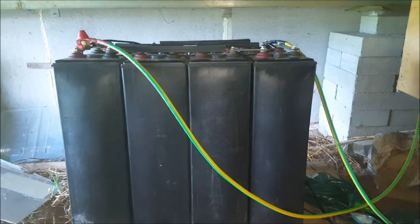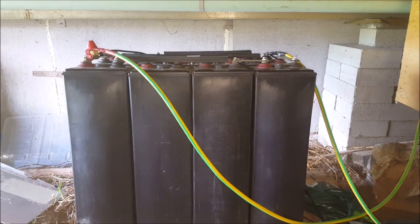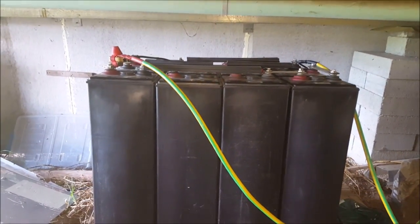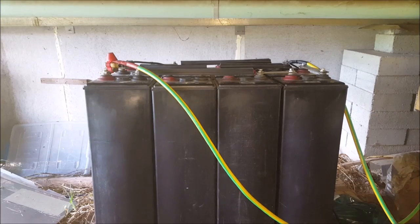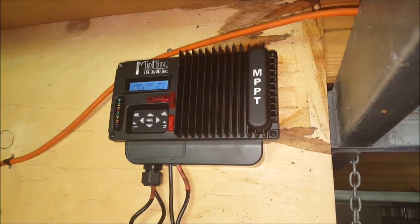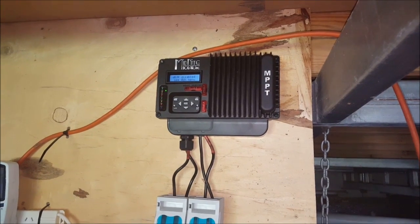And that's only off of that system. It's able to power my whole house — except for the electric stove, the air conditioner, and the lights at this stage. I've got to rig up some 12 volt lighting, but in the next couple of weeks I'll be going off the grid completely. I can get by without the electric stove — I'll be getting a wood heater installed soon. I've got propane instant water heating. One feature of the charge controller is that it has a load dump feature. I have an 80 litre, 20 US gallon electric hot water system.